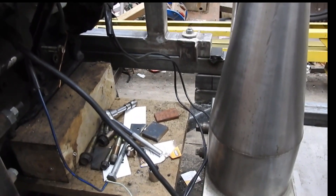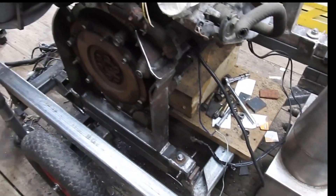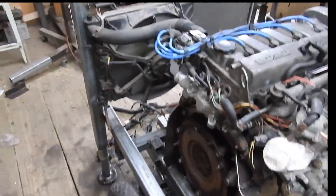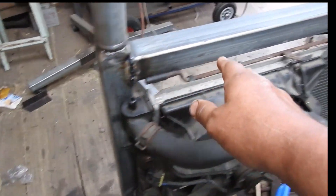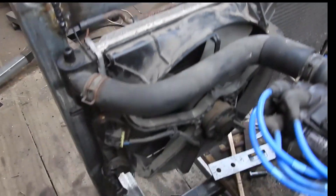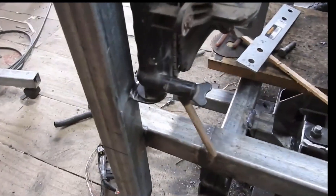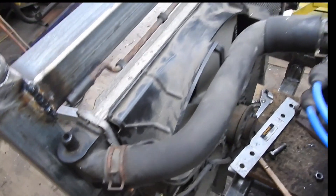I'm hoping this space here will be sufficient for a six to ten kilowatt gen head — that will come later, about two thousand dollars from now. The uprights that carry the lifting jacks have also essentially become the frame for the radiator, with a cross piece here and the radiator sitting behind it. The bottom of the radiator sits on a couple of pegs and the top will be set up on a peg that I can remove to get the radiator out.